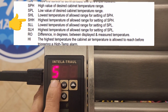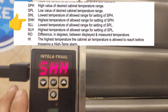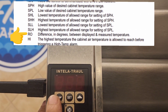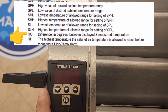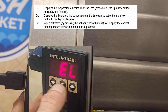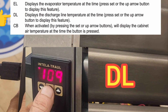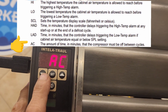There are all these different parameters and settings — I'm just showing you how to get there. I'll talk about the ones that are going to be useful today. Those are RO, which I'll do a little bit later, and the temperature sensors: the cabinet temperature sensor, the evaporator temperature sensor, and the discharge line temperature sensor. You can't diagnose this thing without knowing that.